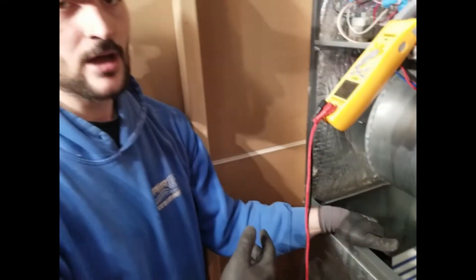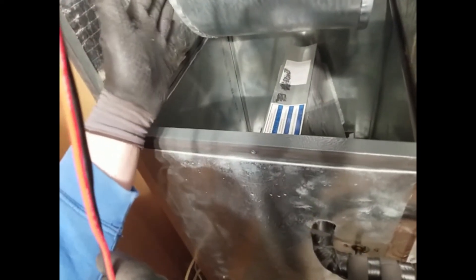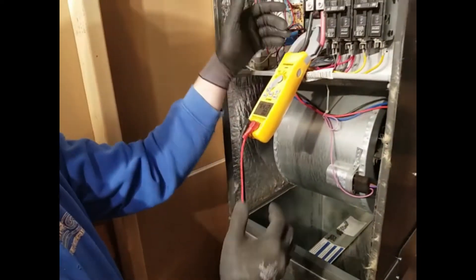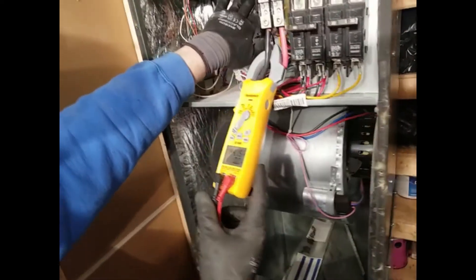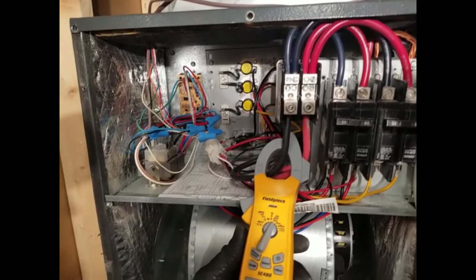When you're blocking the airflow — either by a dirty filter, or a filter that is just too thick (and they sell those everywhere and you might not know it), or your air conditioner coil is blocked — it will create a restriction. What's going to happen is that the elements will overheat. Those parts here are called elements.